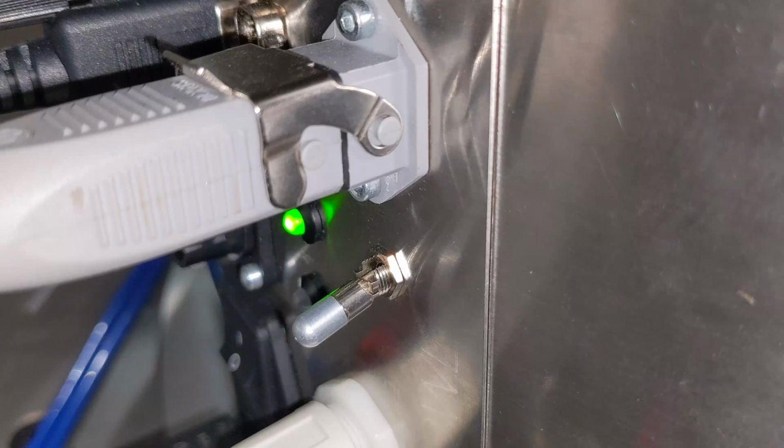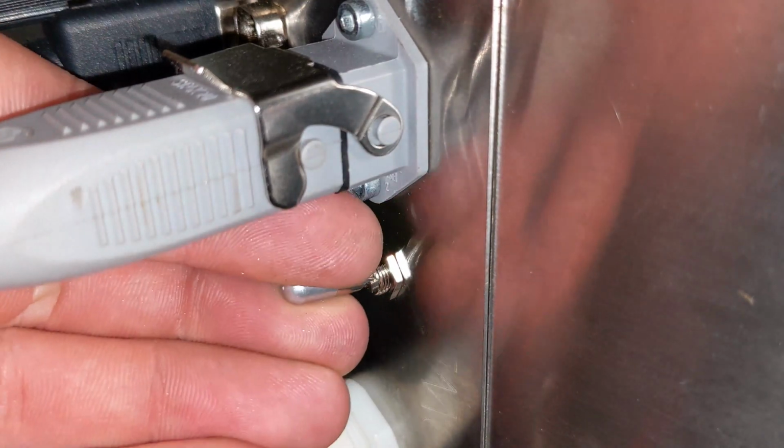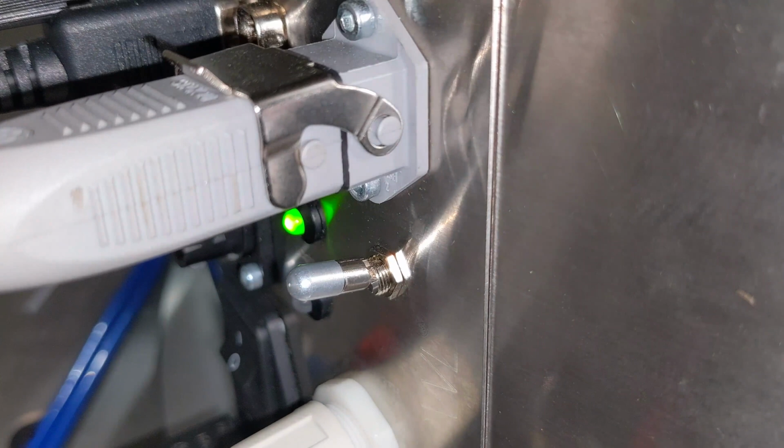When setting up the Flexibowl, you want to first define the parameters with which it operates. Essentially, this means how many times it rotates, at what angle, and at what speed. These parameters are usually custom per part. When connecting, you first want to flip the switch up. If it is in this mode, you have to pull it out and push it up.